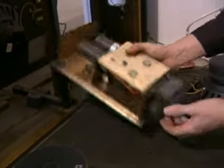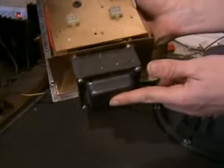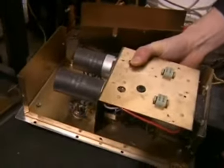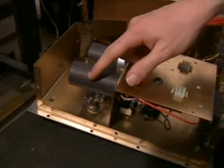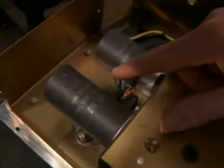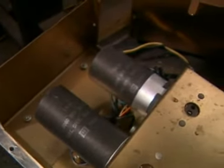The way you find them is to always look for the power transformer. In this big instrument, I can see the power transformer is in this assembly, so I knew to open up this assembly and that was where I was going to find my capacitors. So if I go to the store, I'm going to buy a 3,000 microfarad capacitor rated at 50 volts DC and another 3,000 microfarad capacitor at 50 volts DC.